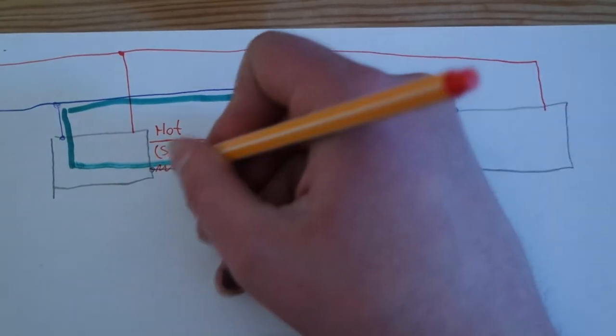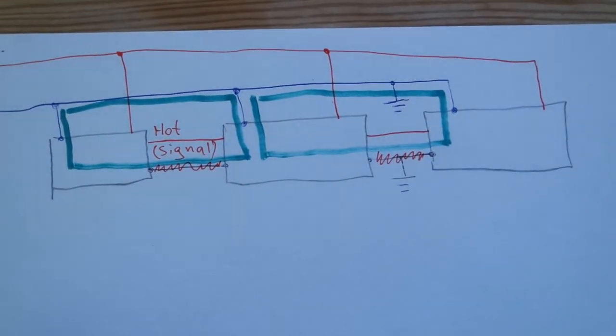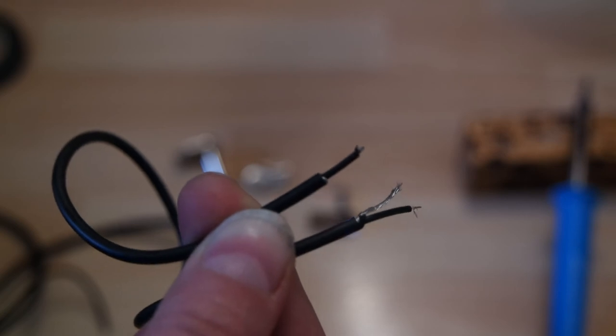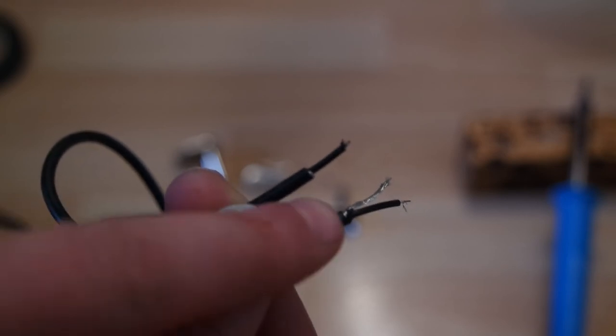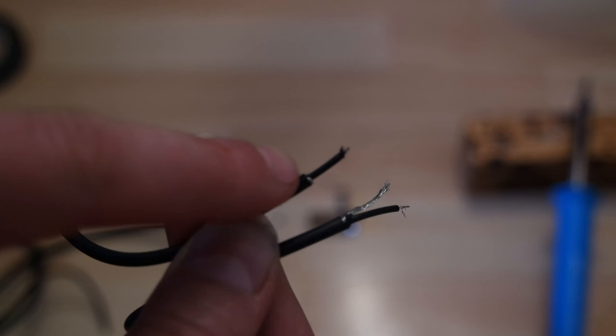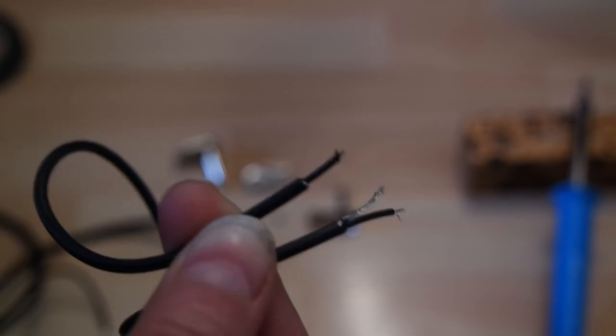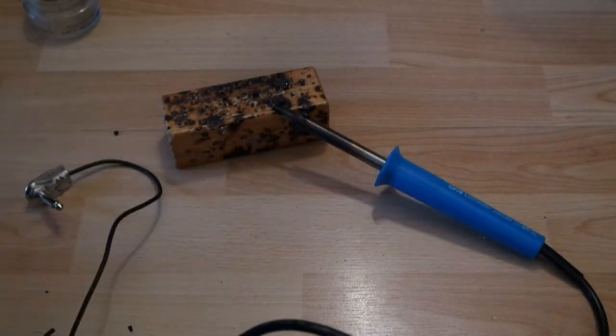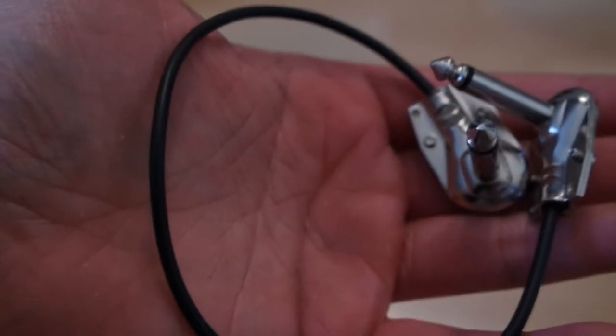You may use a simple life hack if you cut the ground wire in some places. I'm going to solder my own signal patch cable using shielded wire, connecting one end to the jack as usual. On the other end I'll connect the signal wire without connecting the ground. This way the ground of all the devices will be connected through the power cable and there will be no ground loops. With this simple trick I was able to get rid of the noise.